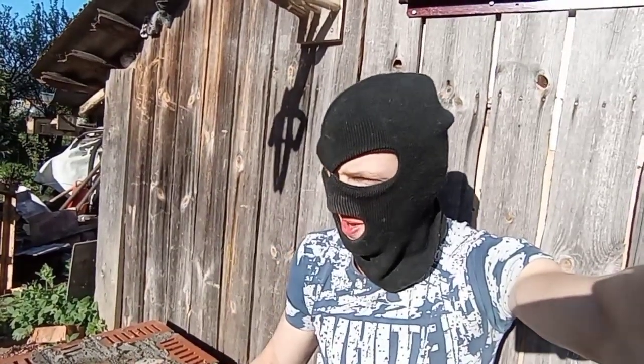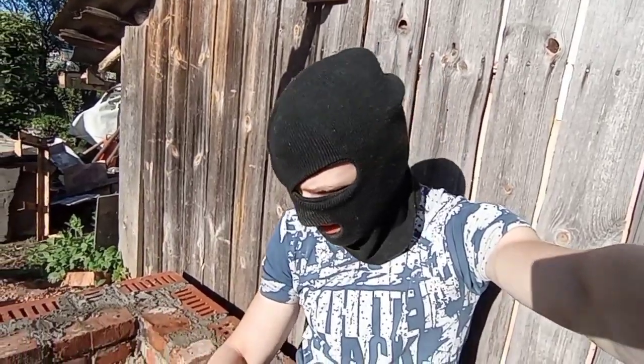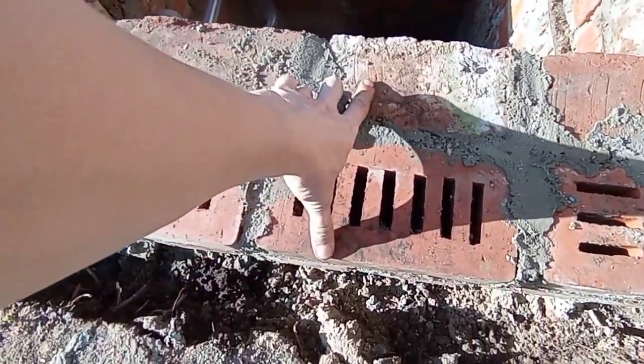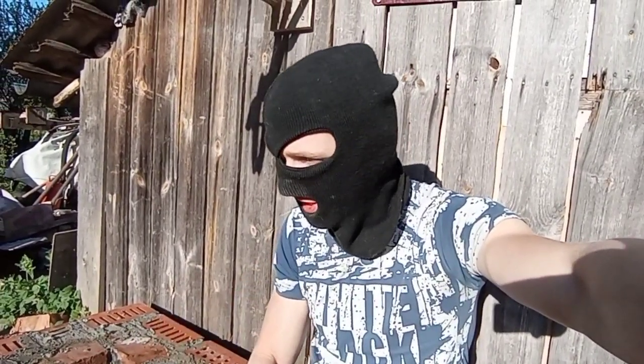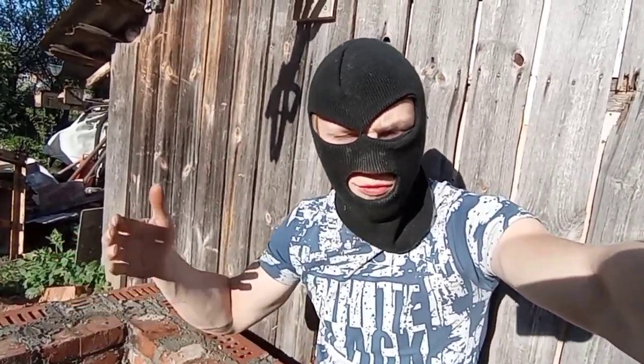This whole project simply started as a tunnel connecting the inside of my garage to the outside, but it's slowly turning from a secret tunnel into a goddamn bunker — look at the thickness of these walls. These walls are literally 25 centimeters thick, the standard length of a brick, almost one foot thick. I also put little pieces of rebar where necessary, like in the corners. This is no longer a tunnel, this is almost like a bunker. I might have to rename the next video 'Secret Bunker' instead of 'Secret Tunnel' — just look at the thickness.